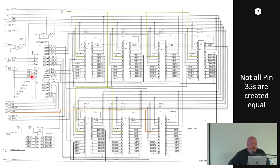Now, this does bring me to the fourth page, and the last time I'll say why I couldn't come up with an automated way to do this. Here's the seven slots of the 2GS, and at a glance you might say, oh, these are all on a bus, and all the pins are connected together and go to a common set of signals. In a world where your only way to read a schematic is on paper, this is probably the most efficient way to communicate how things are connected across a page like this.